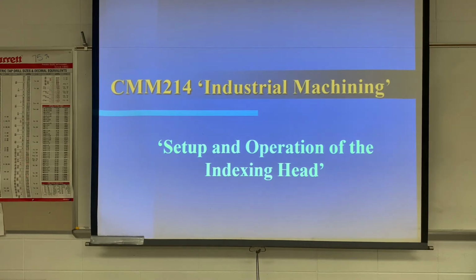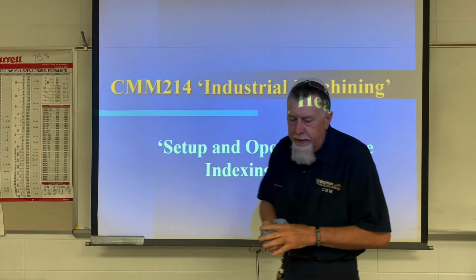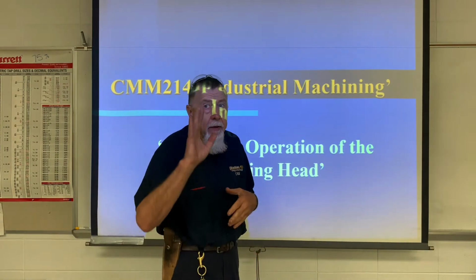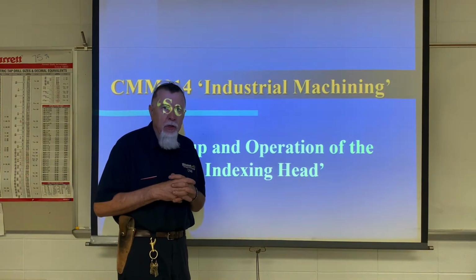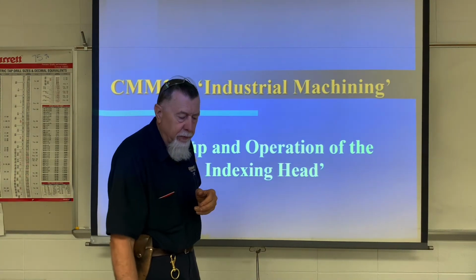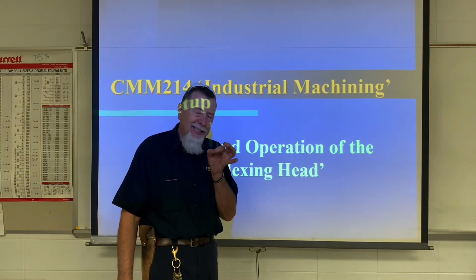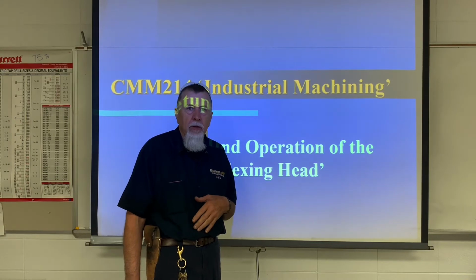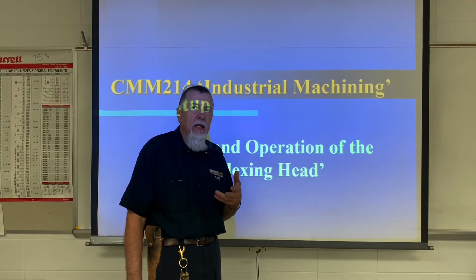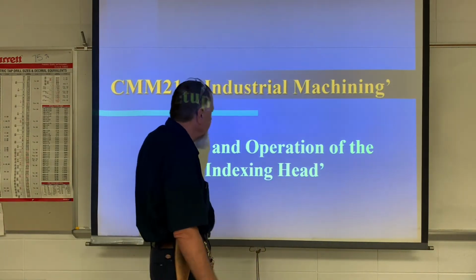All right, in this video, we're going to look at how to set up and operate the indexing head that is mounted on our Acra vertical mill. Typically, they're on a horizontal mill, but we have ours set up on a vertical mill. It's the indexing head that you probably use to put the hex on the center bolt of your tool post, to put a square on your key seat shaft, things like that. But we're going to use it to cut teeth on our spur gear.